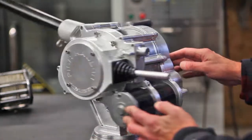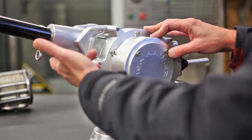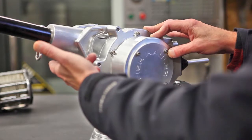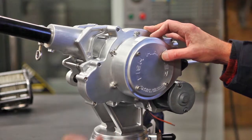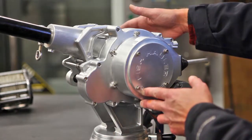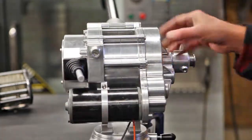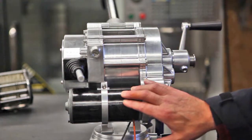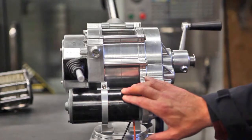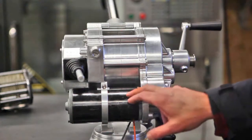In development, in your line, there's either going to be a load sensor that will give you direct reading about weight of line, pull, and you can tell how big a fish you have on it. Also in consideration is in your control panel, it'll be a reading from the amperage draw on the motor and a calculation that will show exactly the amount of weight the line is pulling in through monitoring the amperage draw on the motor.